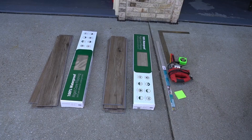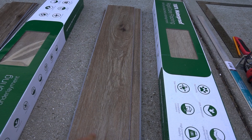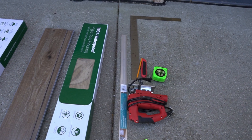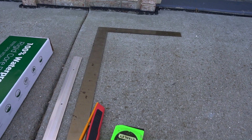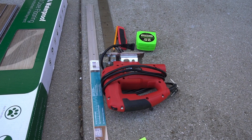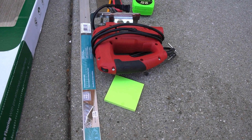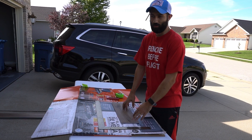Here's that flooring, and it does have the pre-attached underlayment, which is really nice. It's still not so thick that it can't go under the pre-existing cabinets or the refrigerator — it actually slides right under those. Other things we're going to need: a pretty big carpenter square, pencil, razor blade for scoring the flooring, tape measure, a jigsaw for getting around some of those weird corners and making notches, and a notepad for taking down measurements.